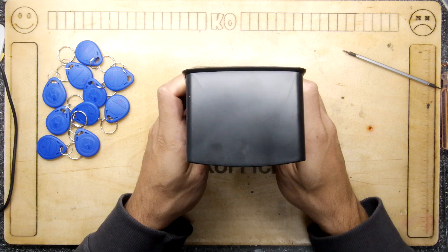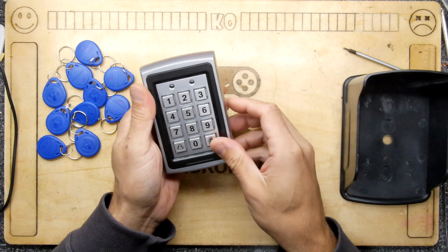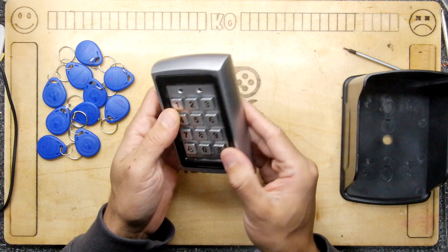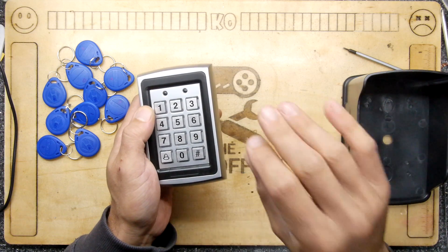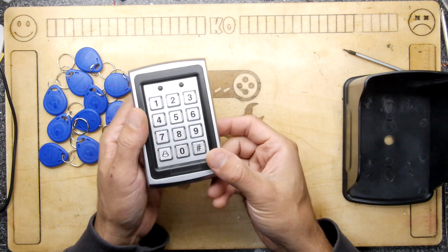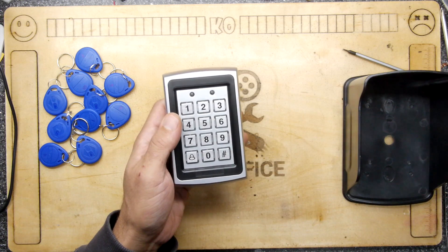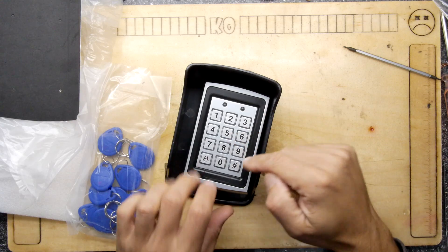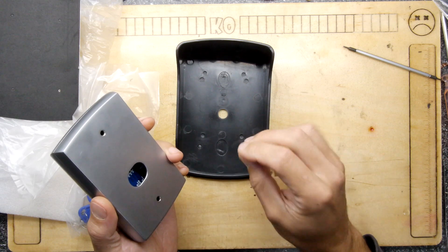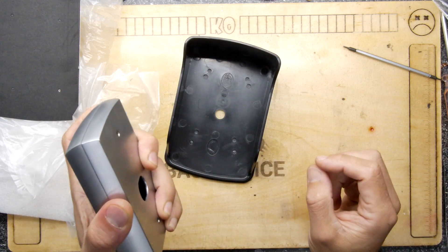So there you have it — if you're interested in access control for a gate, door, or garage, RFID and PIN is nice and simple. I know you're thinking about Wi-Fi, but if you start looking for a semi-commercial system — something more advanced than a standard Ring or Amazon doorbell that also does door locking with a camera — the market doesn't really have too many things on offer. You need a systems and engineering approach, and this is one aspect of it. One last tip: if you're concerned about someone levering this off the wall and accessing your wires, put a Lucas-type or bullet connector in the cable inside the wall, and make sure the cable on the other end is clamped so that if they pull it, it will disconnect. Top tip.